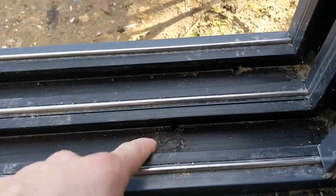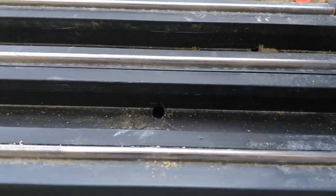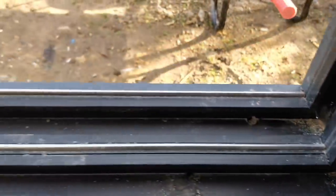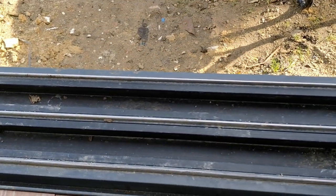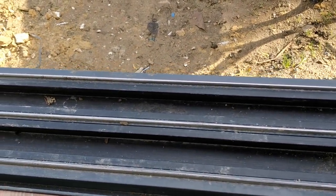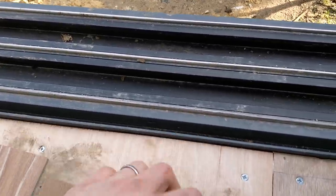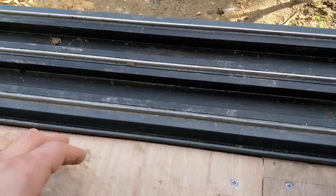Drainage holes, the weep holes. Don't know how easy it is for you to see that there's one there. There's another one back there. Occasionally I need to clean them out because we're still walking in and out and it's muddy and dirty. That's not the window's fault, that's our fault. But we haven't had a single leak since we made all the remediations, folding up the DPM, butting everything up.